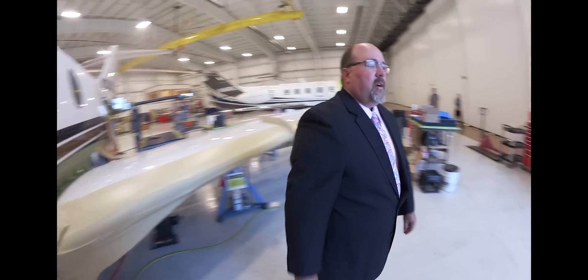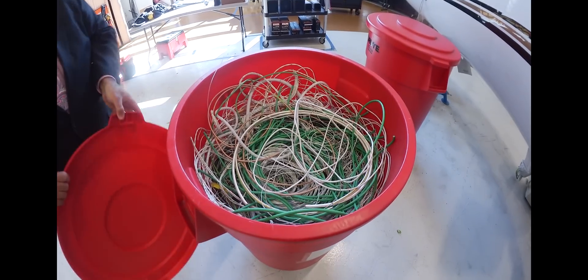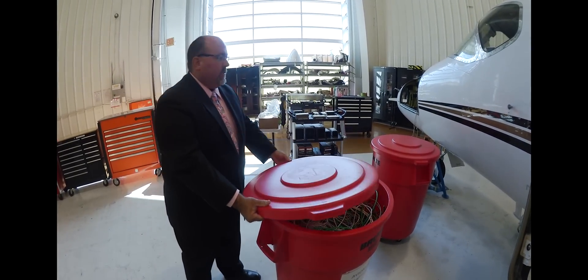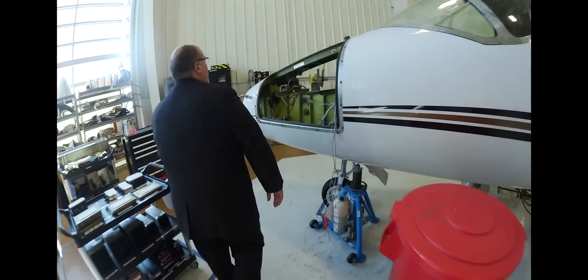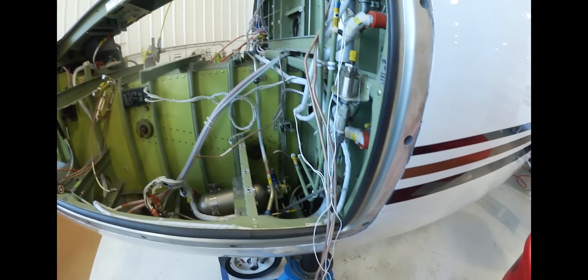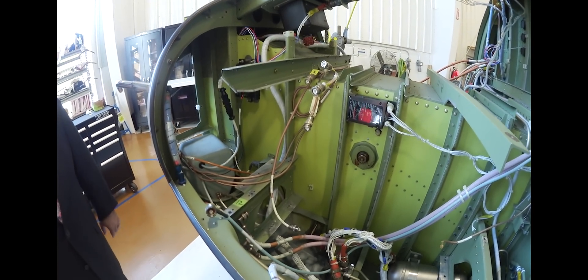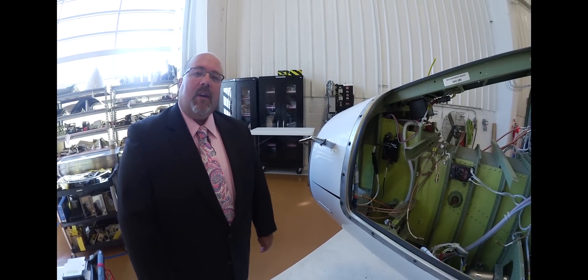Behind us you can see there is a tremendous amount of wire that comes out of the aircraft. We fill up several bins of wire here — all recycled — which gives you some idea of the volume we're removing. Up front you can see that the avionics bay has been deleted, removed. All the connections are being fabricated new in our wire harness shop here in-house. We also have access to components like the outflow valves that you would never normally have access to, so this is the time we take to make sure everything in the aircraft is inspected.